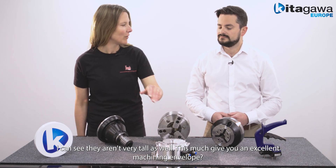What kind of sizes of workpieces can be used? Well, anything from 12 millimetres up to 82 millimetres. We can also manufacture specials for larger workpieces. I guess because the cylinder is so versatile, the workholding options are limitless. Exactly. Kitagawa Europe have released a few models, a few of which you can see here today, including a BR chuck, expanding mandrel and collet chuck.